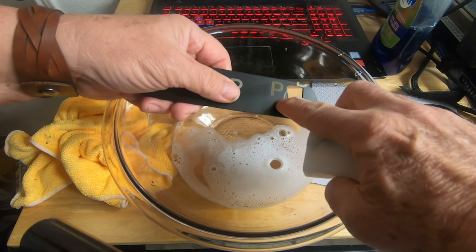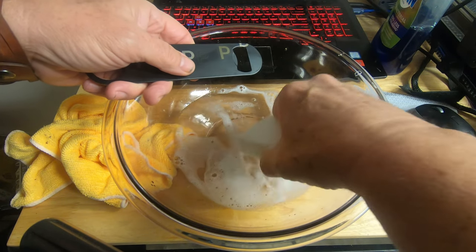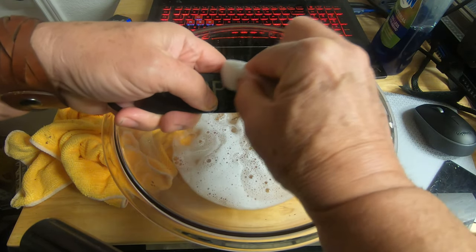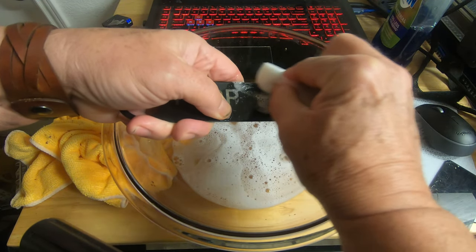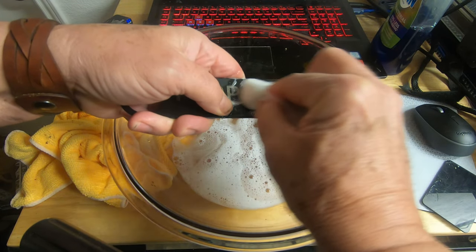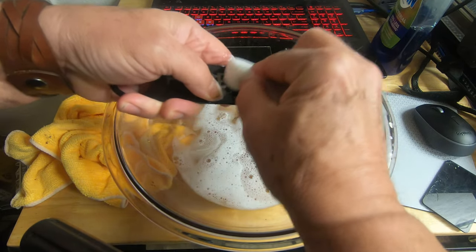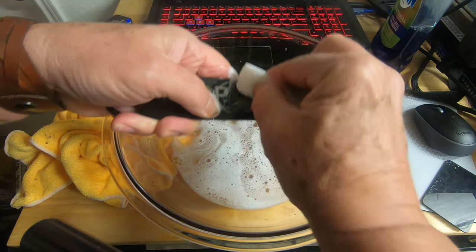Okay, so this P right here is the one that was done at 3000 speed and at 40%. So let's clean that one up. And you can scrub really hard and clean all this stuff out good. It's not going to scratch it. That's a good thing about the Magic Eraser. It does not mess up your paint. It just cleans up the residue off of the letter itself, or the cutout. Takes it back down to the stainless steel. And if you do it enough, it actually will polish the steel up a little bit too, make it look really good.